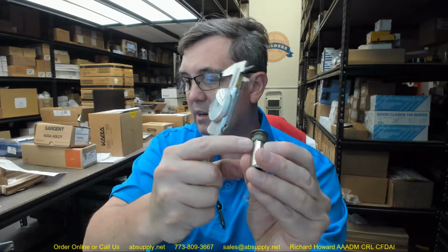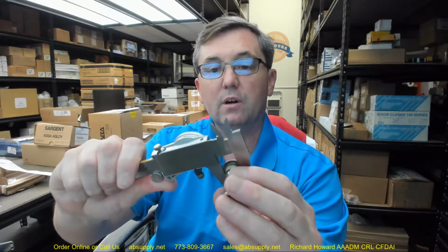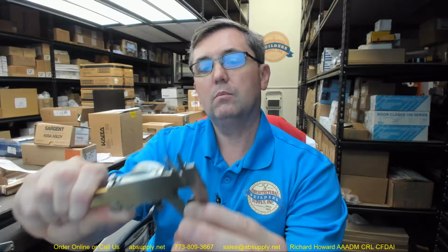9/16 hole, let's take a look. Yeah, sure. There's a little collar over there to make it fit nice and tight, which is just heavy on 9/16. Overall diameter of the face, 0.762. That body diameter, 0.492. They do want 9/16 because that shim that's there is coming in at 0.555, just to compress it inside there is the point.